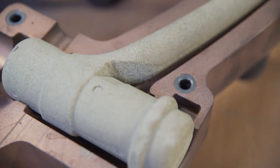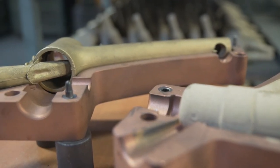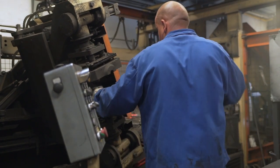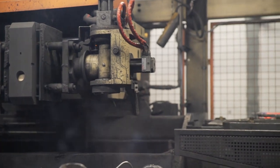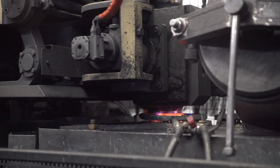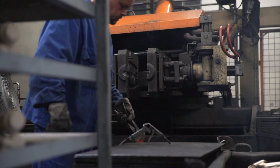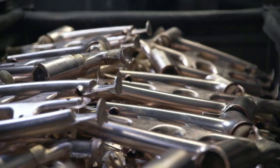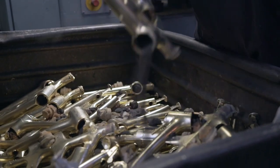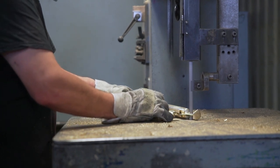The sand core is placed inside a casting mold. Liquid brass is poured into the mold and then fills in the void between the sand core and the mold, which produces the desired shape of the fitting. It takes place in this oven. Liquid brass, preheated to a temperature of 1,000 degrees Celsius, is poured into the mold with the sand core inside. When the mold is opened, the fitting is ready. After cooling down, any remaining silica sand is thrown away and any extra material remaining after casting is cut off.